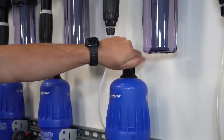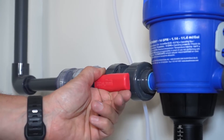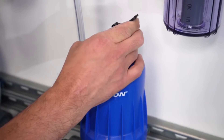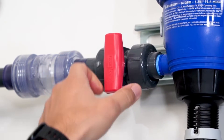Put the bypass lever to the on position and open the drain valve on your monitoring loop. If your pump needs to be powered on, do this now. Set your start valve to the open position — water should start flowing through the dosers with the infamous click-clack sound. You will start to notice nutrient solution flowing up the tubing. Once the nutrient solution has reached the stem, turn the bypass lever to the off position to avoid wasting nutrient solution. When priming an entire rack, continue this process, watching each pickup tube and turning bypass levers off one by one. If the nutrient solution is not moving up the tubing, there could be a leak in the connection between the stem and tubing, or the check valve may not have a proper seal. Once all pickup tubes have been primed, set the start valve to the off position. You can leave the drain valve on the monitoring loop in the open position for the time being.